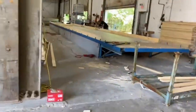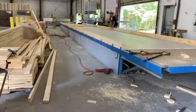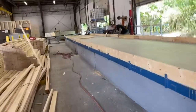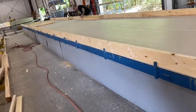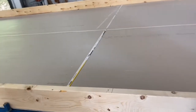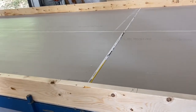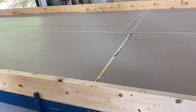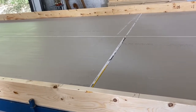This is something unique to the industry, really. When we frame, these are all exterior walls we're doing here. So when we frame an exterior wall, first thing we do is we'll put down drywall. Then we frame the wall. All our exterior walls are 2x6. You just lay the drywall first. Lay it down. We blow off the table, make sure there's no foreign objects on it. We lay it down. We'll frame it.